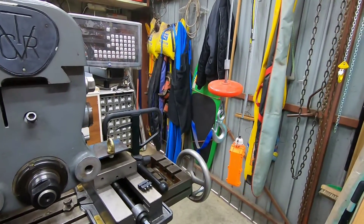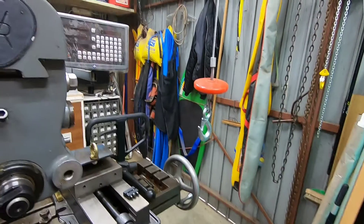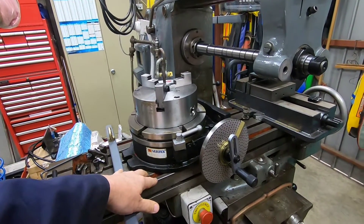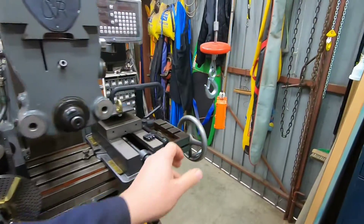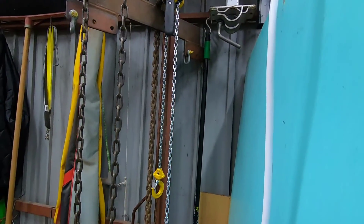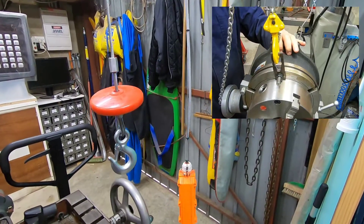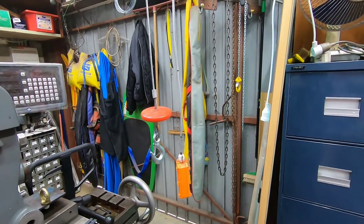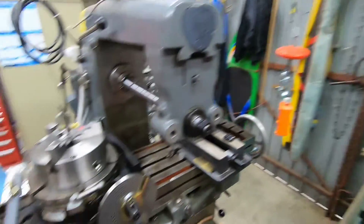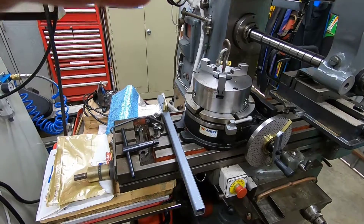The powered hoist will raise and lower obviously with a lot less effort and much faster, but the problem with it — excuse all this handheld nonsense — is the start and stop is very fierce. There's no lead-in, so when you go to lift something off the table, if you don't get a clean lift it bangs it on the table. And when you go to put it down it's very hard to do it gently. To address that problem in the past, what I've tried to do is use this smaller lever hoist — use that to get close and then use the lever hoist to do the final raising. That works, but it's just a little bit tedious. I was out walking the other day and it suddenly occurred to me that maybe there's an easier way, and that's where this bar might come in.